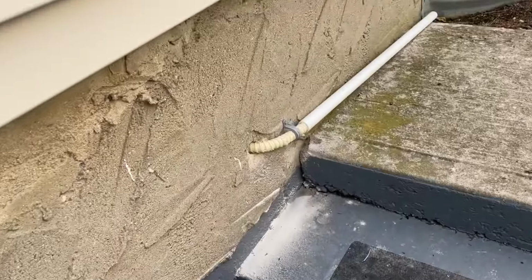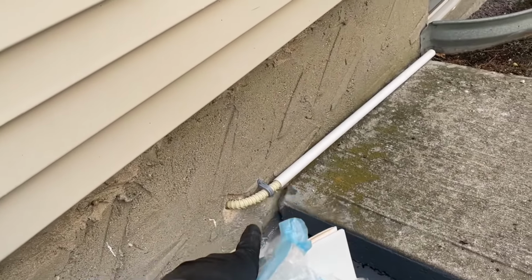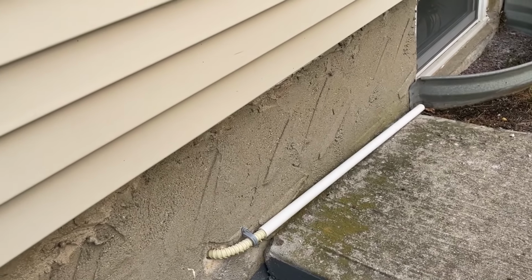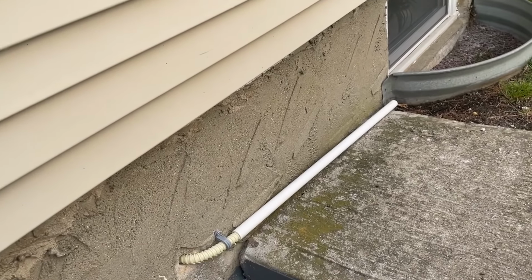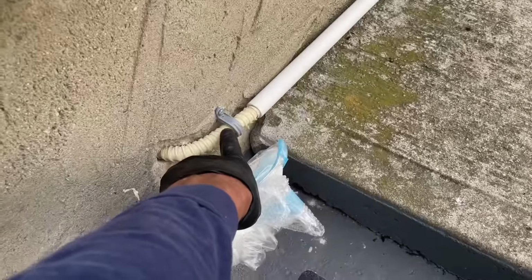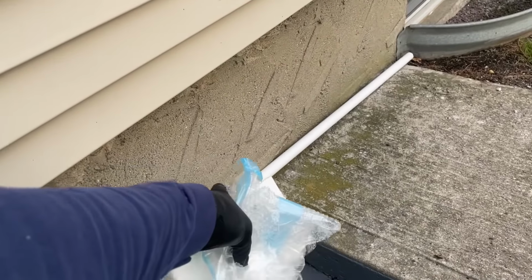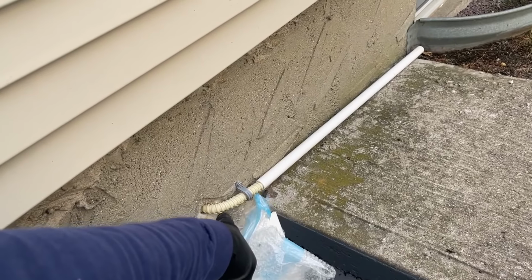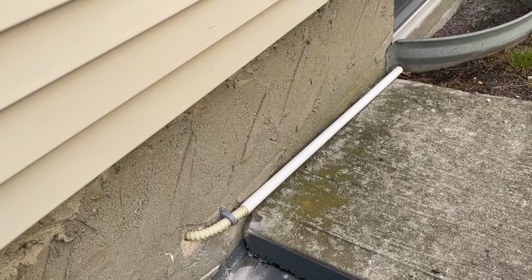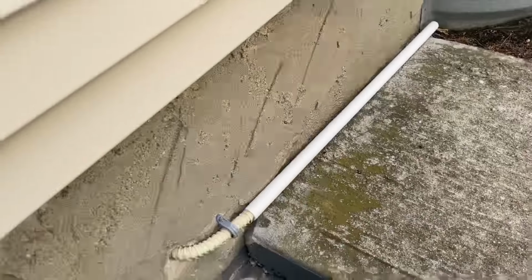Now, what I wanted you to do is think about this logically. Today is about learning logic, using your head, right? The white PVC pipe can still move around now. I wanted you to use that over that just to hold it in place. So try to loosen that up and maybe cut back the flexible condensate line coming out of the back of the unit. I only left it long because I wanted it to reach the dirt. But I guess you could put another clamp right there.